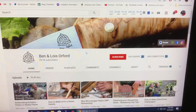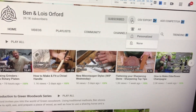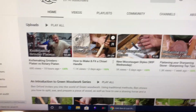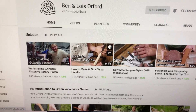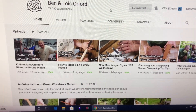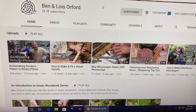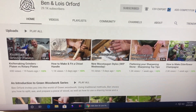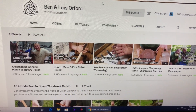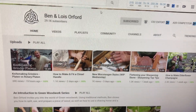Wedgedale Leather sent me a link to this guy's channel and I just subscribed, because he's using stainless steel tool wrap and showing how he uses it. That's what I'm looking for — I'm going to start buying some tool wrap and wrapping my tools to avoid the decarburization burns I'm getting on some knives. You can sand them out, but when you've already sanded a blade up to 800 grit and then heat treat and temper it and realize you've got decarburization burns, you have to sand back down to 320 on a hardened blade — it's a lot more work.